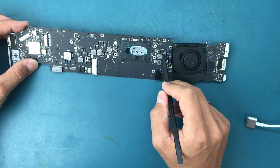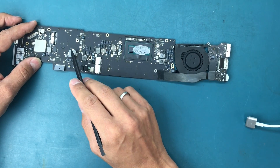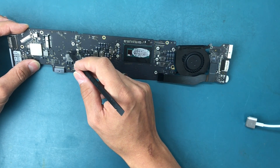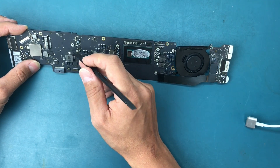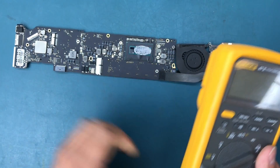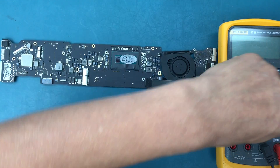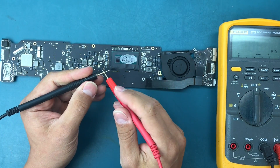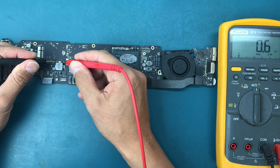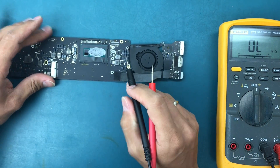The fuse may be blown because they're both sitting on the 12.6 volt line coming from the coil. If that one is shorted, maybe it shorted this one somehow and that's why it's getting hot - unlikely, but we can do some quick resistance measurements. Here's the multimeter - power is unplugged, rule number one. We put it into ohm-meter mode. After measuring, the fuse checks out okay.